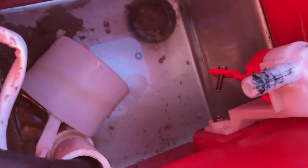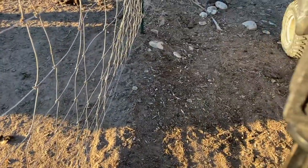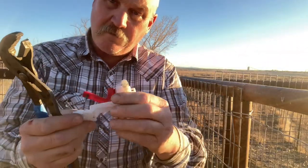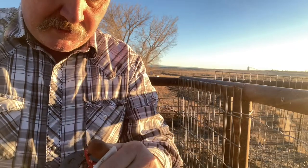What I've done is disconnect this rubber hose and pulled it out of the way, pulled the float off — it just bolts on with a wing nut right there. So I think I can just screw that float valve out of there. I'm not exactly sure how that goes since it was all assembled when I got it. Looks like I had to take this whole valve all the way out — there were just two bolts that go through here. I've never been into this; the thing came assembled.